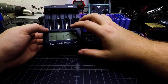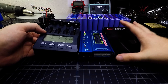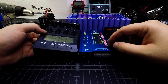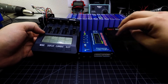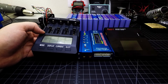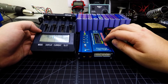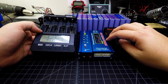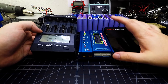These RC chargers can discharge and measure capacity, but they only do it one battery cell at a time. If you have a lot of cells to test, the Opus is probably the way to go. With these RC units, discharge is still limited to one amp because when you're discharging, you're essentially dumping power as heat while measuring the milliamp hour consumption.